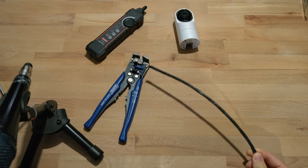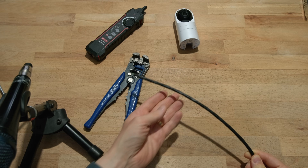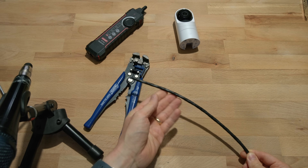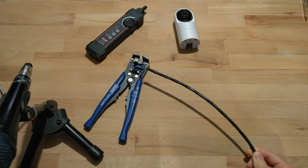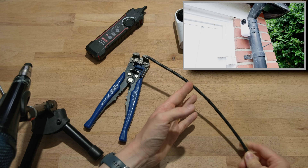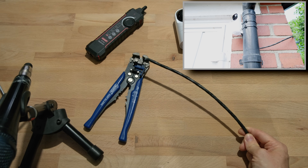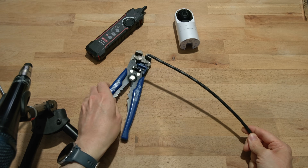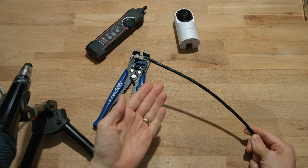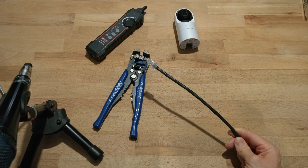The main reason I got this cable was that it was pretty affordable and had the necessary outdoor rating. This is the UK so it's not going to have to survive a blizzard — it just needs to provide some shelter, and most of the run is tacked onto the side of the house. The camera itself also goes underneath the gutter which provides some protection. I've stripped the end off with my trusty wire cutters and now I'm adding the RJ45 jack to the end of this cable.